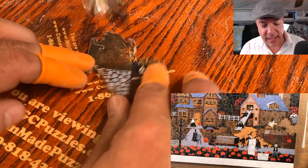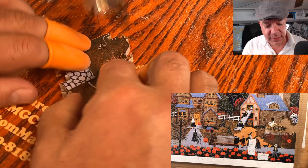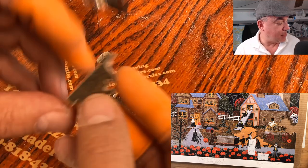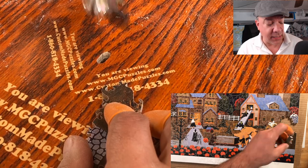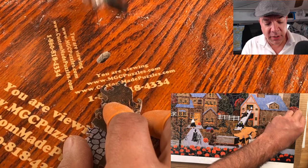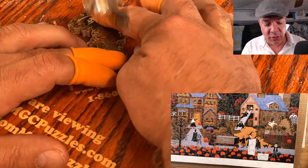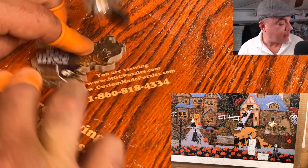And they leave these gaps, and sometimes there's little spots where there was a knot, and so there's sometimes no wood there at all. When you're cutting these tiny little pieces, you'll hit a spot where the upper part and the lower part of the wood literally have no connection, because one of the middle layers is either rotten or outright missing. Or you'll have a little gap, maybe a 1/4 inch gap, and if those aren't so terrible, you can squeeze a little glue in there when you discover them and let that set overnight, and then you can go back to cutting the next day.